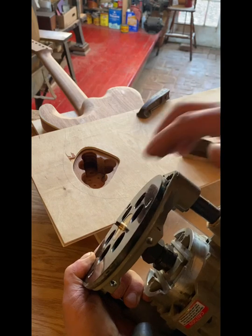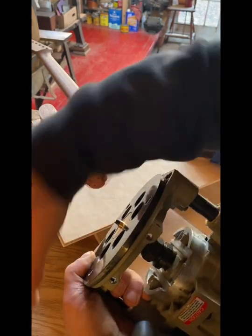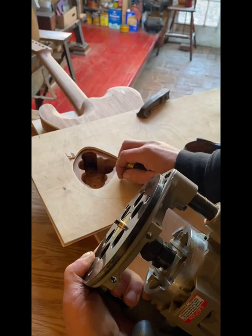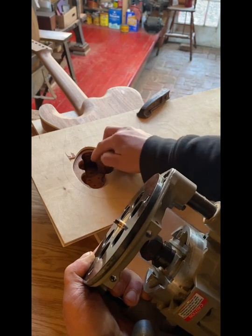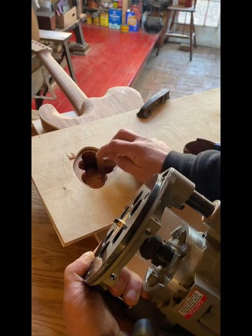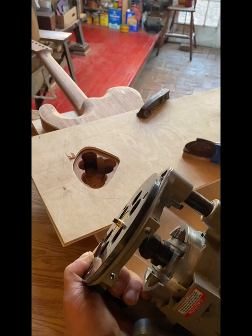But we're just going to take this down, and then we're going to come in with our larger collet, which will take the bit way in, leaving the lip that we're going to make now, and we'll clean all this up and leave our 3 little tabs for our screws for the access plate to cover. Okay, let's do this.